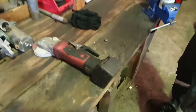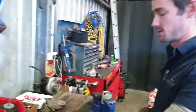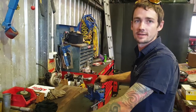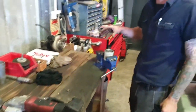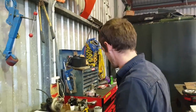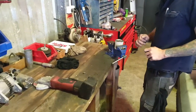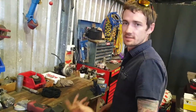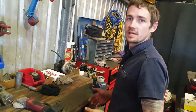Damien's got it set up over here, so we'll go have a look at the gear that you need to get it done. You want to take a set of cutters. The grinder's not the most ideal thing to cut open a filter. You can get a filter cutter for probably about $30 on eBay — they do a much better job. But for what we're doing, a grinder is probably the most accessible thing you have. You just got to take your time and realise there's going to be a little bit of dust in there, but you're looking for brass and alloy anyway.